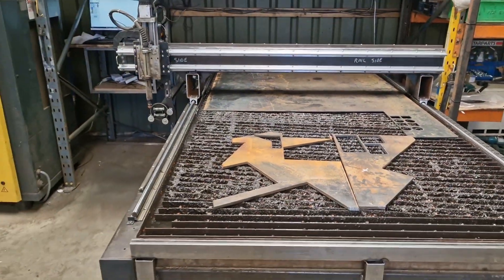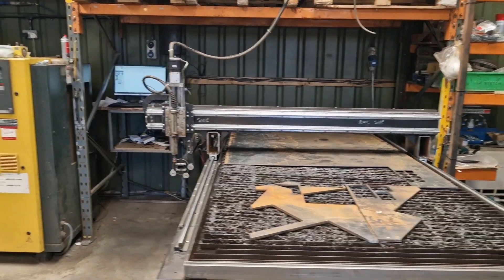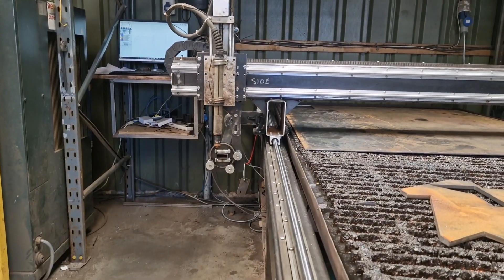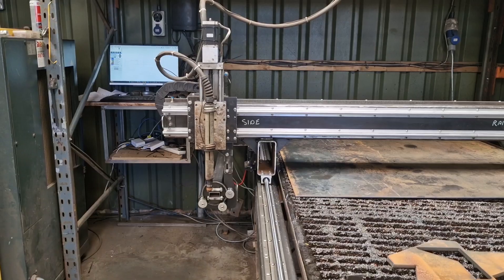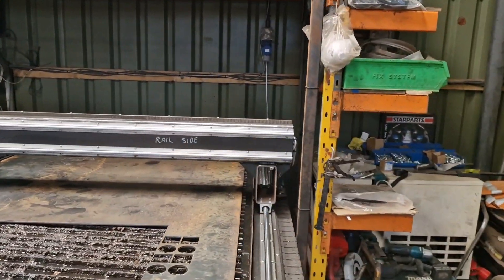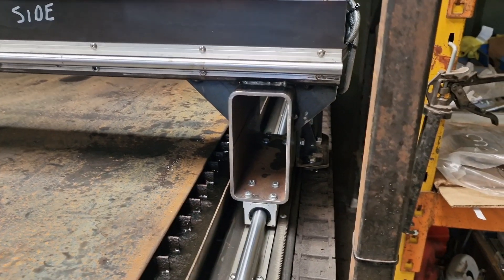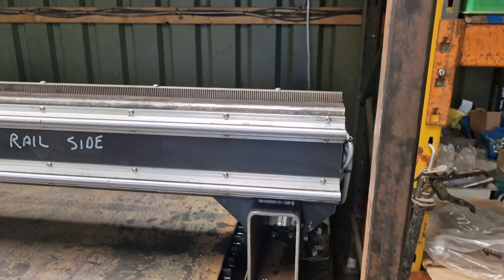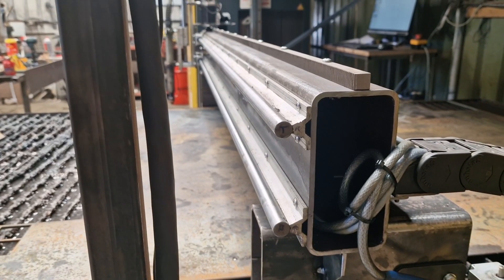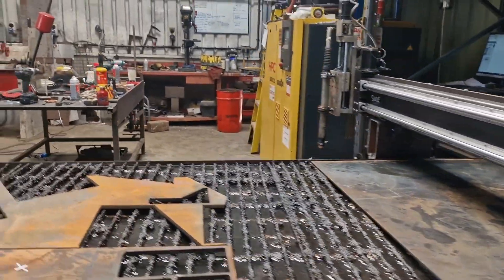We have now increased the beam length, as you can see, to accommodate the rotary. We're looking at the rotary sitting like that. We've gone from 100mm to 160mm and used thicker material. We've gone front face with the SBR, cut that down to SBR 16mm. It seemed a more sensible thing to do — mainly because I had it.